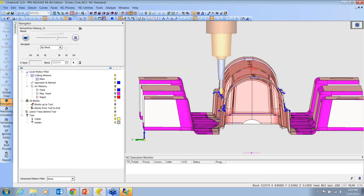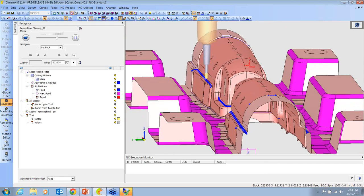Again here, when it doesn't have to tip, it's not going to tip, because if you haven't seen a five-axis machine move, you should know that it's not always the most efficient means of movement, and sometimes the tool will hesitate as the table's turning or something. So the more often you can stay in three-axis machining, the better off you are, but when you need five-axis, it's pretty nice to have.